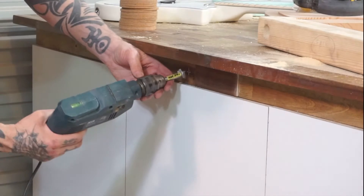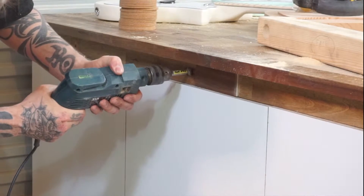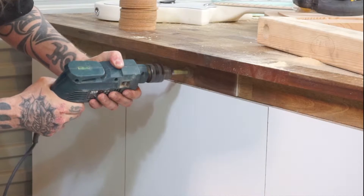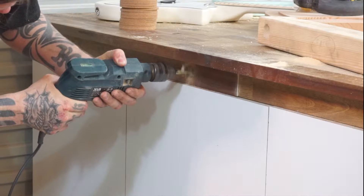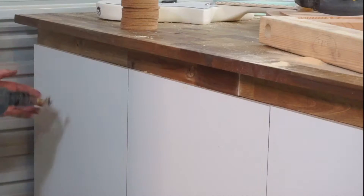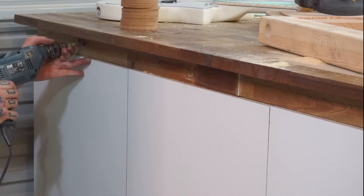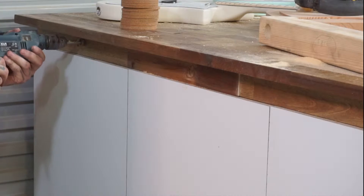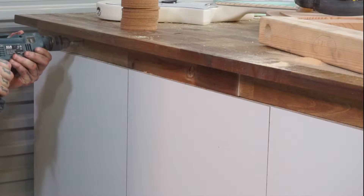I've used the finished spacer block with the holes in it as a template and marked the points for this Forstner bit to drill right through the front of the cabinets. If you have one of those drill stands that's like a portable drill press, this is a great excuse to use it, as you want your holes to be as straight as possible here. I did engineer a little bit of wiggle room, but if these holes are too far off, the vice won't sit straight.